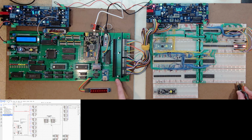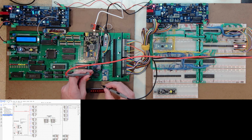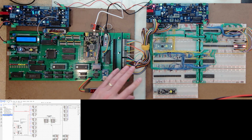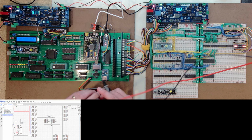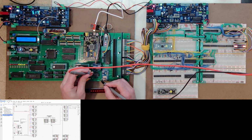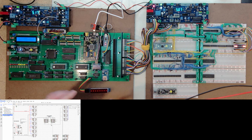I probably should check it down here also, just to make sure there's not something down here that is more of a concern. And let's see, I think I'm just going to check it on this IC. So power ground, and there I'm at 4.849. So this right now is the lowest point on this entire thing. So I probably need to bring that back up, I want to be high enough, I guess, to get 5 volts down there. So let's just see if I can get that somewhat close. 4.9 at that point.